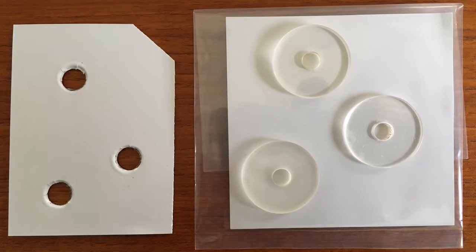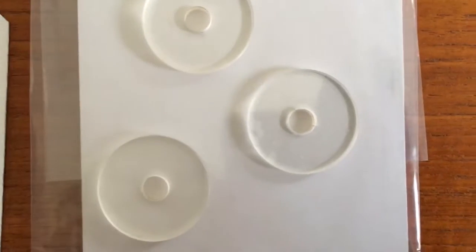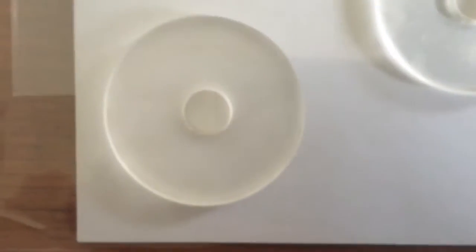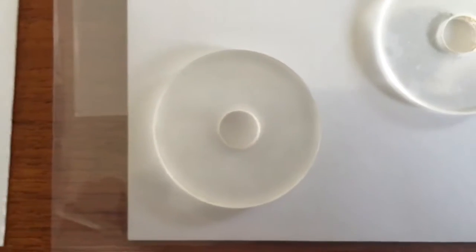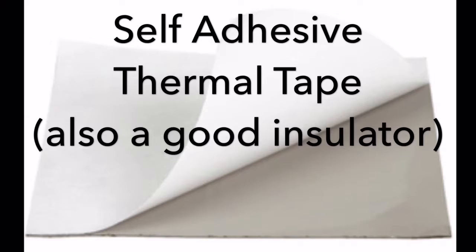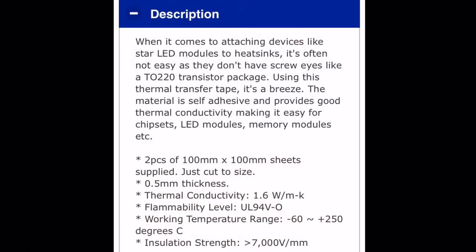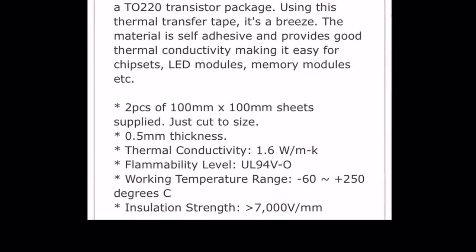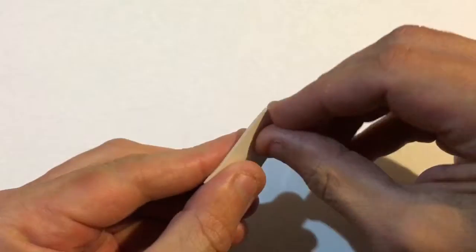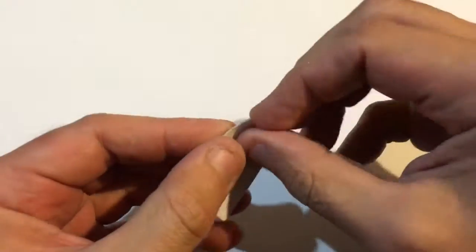In the last video I mentioned I'd need some kind of washer to insulate between a standoff and the ground plane, so I've requested on a forum and someone's lathed me up a few to try. I'm using thermal tape as a gasket either side because this insulator is from the inside to the out. The thermal tape — you might have used it before to mount several transistors to a common heatsink and electrically insulate them. It feels very much like self-fusing silicon tape.